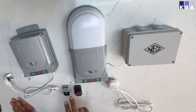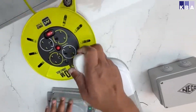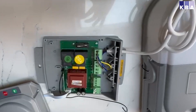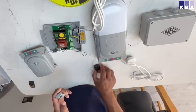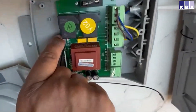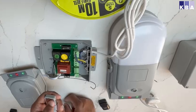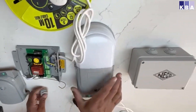I'm going to show you how, when you get a new remote, you pair it with these boxes. I'll start with the Euro box. Normally what you do is undo the four screws, take them off, plug it in, and you will see there are two lights on. If the remotes are gray color, you need to program the gray remotes on there — the black one won't work. Press the programming button for one to two seconds, then press the up key on the remote, and you'll hear a click sound as it picks it up. That's for the Euro one.